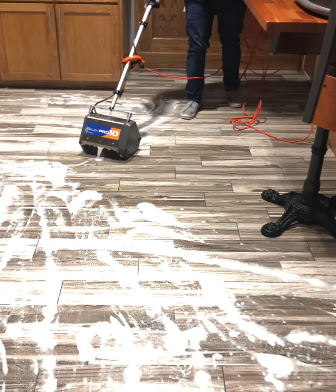So like I said in my earlier video, earlier today, I don't know how people do this without a truck mount. It's so much more thorough. A lot of guys are running a side to side with a brush or a pad, and they're water vacuuming it up. But this machine with the heat of 220 degrees and the pressure at about 1,000 to 1,100 PSI, and then with the vacuum, it really does a really good job.